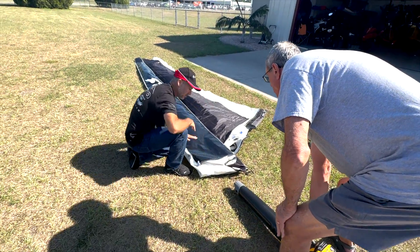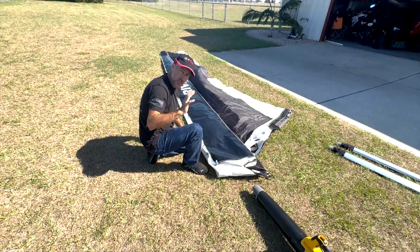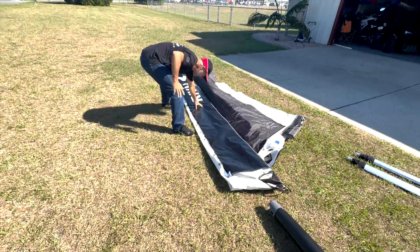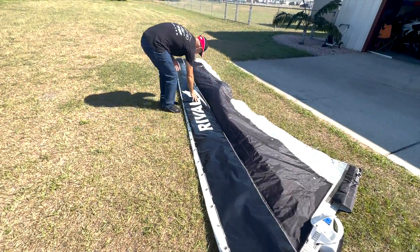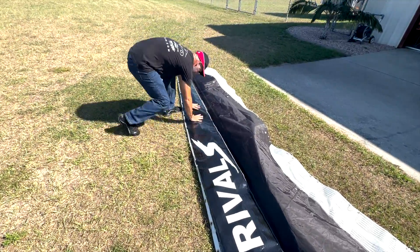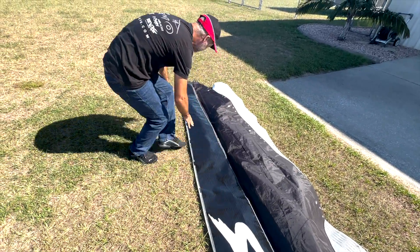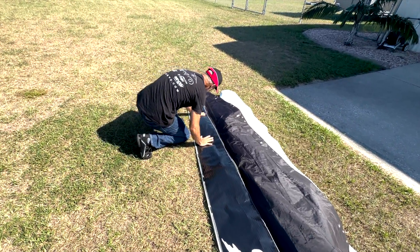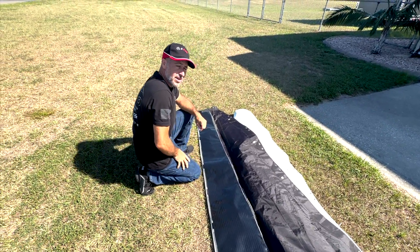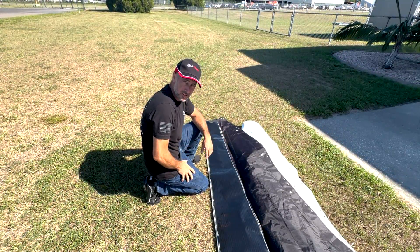Now I'm going to start patting it down. It is possible that the end curled, and we want to check for that — if it did, we've got to pull it out and start all over again. So I'm going to keep patting it down. Here's a high spot. There's some curling, but it's flattening out as I'm pushing it down, so I know that's all good. We got it. And that is how to put a piece of mylar in fairly effortlessly using a blower. Thanks for watching.